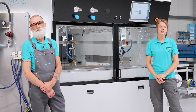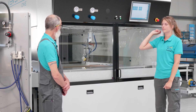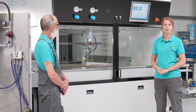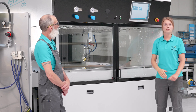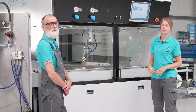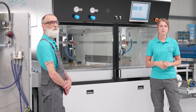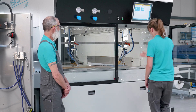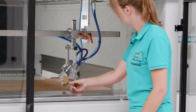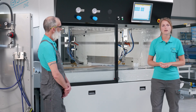In order to clean the spray guns, we first go into manual mode and move the gun drive to the middle so that the filter mats are not additionally contaminated. Now we can spray each individual spray gun by hand. When the guns are cleaned and only clear water comes out, we move the gun drive back to the start position. Next, we unscrew the nozzle heads and put them in solvent so that some incrustations and paint residues can be removed.